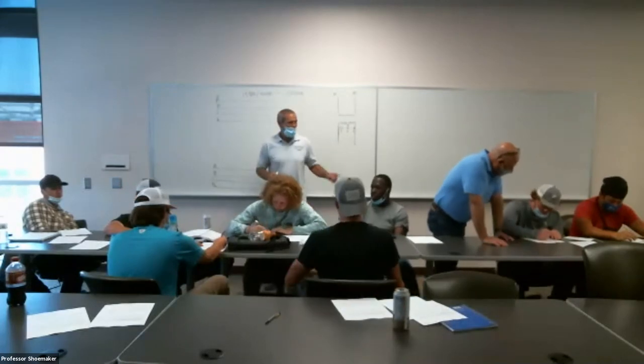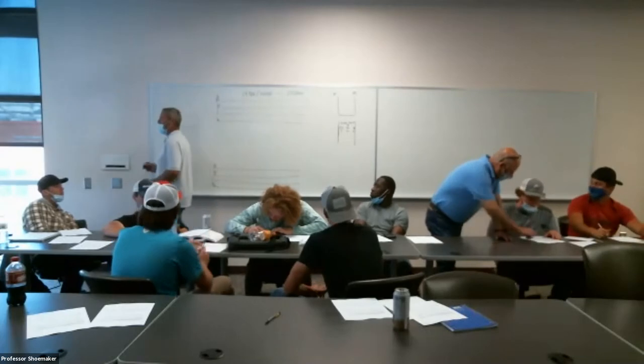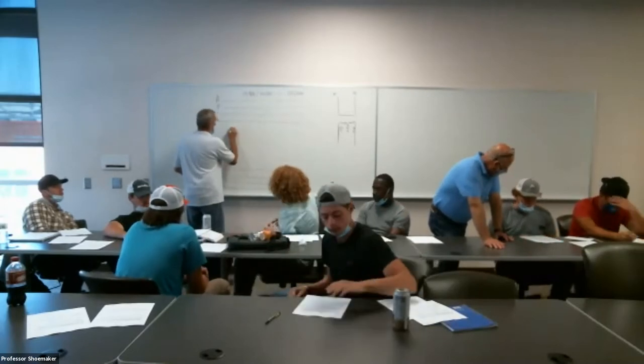So I'm sure he can catch up to this part. Closed Delta, how many transformers do I need? Three. There's a specific reason why I pulled closed Delta first. You'll realize it here in a little bit. So I'm going to draw in three transformers.